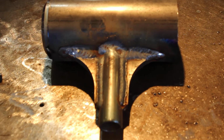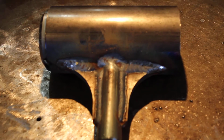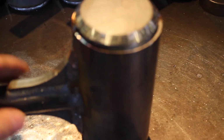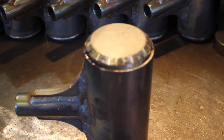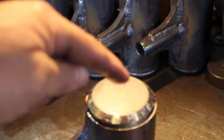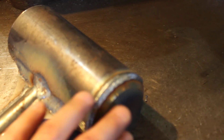Here's a head that has had the weld passes laid in, so our neck assembly is now fastened to our head tube. We just tacked on a few tack welds before the weld goes onto our head cap. And that gets welded 360 degrees. And here's one that's being welded. On this grinding disc here, we will actually buff this weld smooth